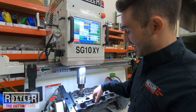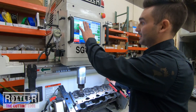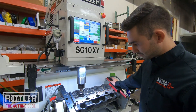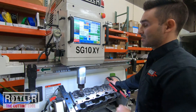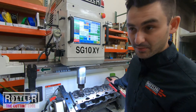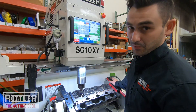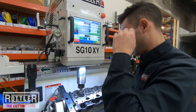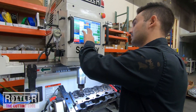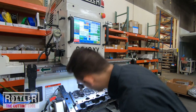I'll click yes and you can see it just moves down and starts cutting almost immediately. I'm going to need to go a lot deeper, so I keep pressing yes — taking another 10-thousandths down, another 10, another 10. Especially when setting up for an R&R where you're putting new seats in and don't know how much material to remove, this is your fastest way to figure out the final depth. You can also change these increment buttons by pressing and holding them — a 4-function calculator pulls up and you can type in 100-thousandths or 150-thousandths, whatever increment helps you work fast enough. For now we'll keep running — looks like we've got about two angles there, so if we can get the top angle to come in...